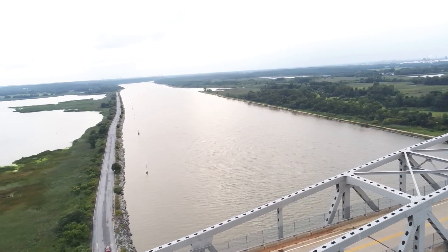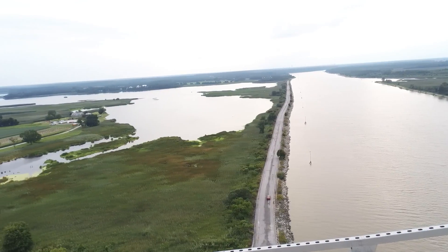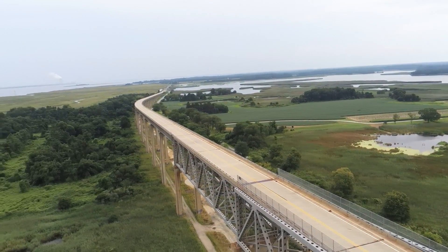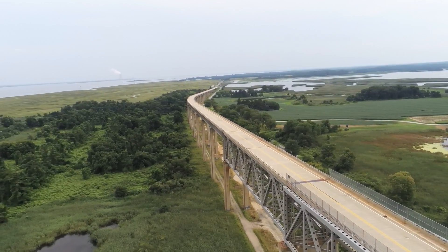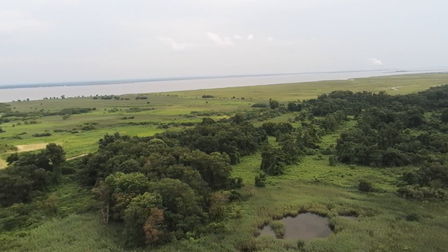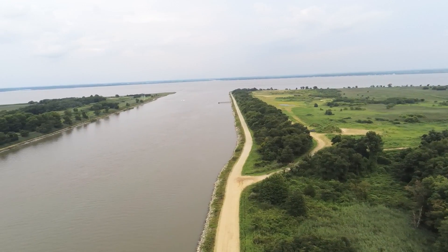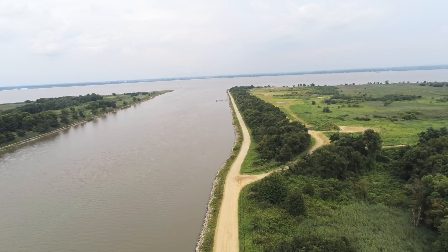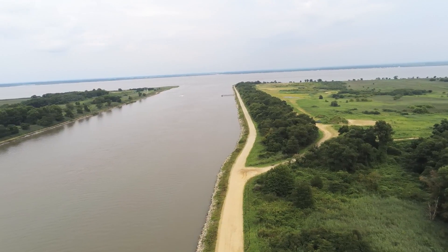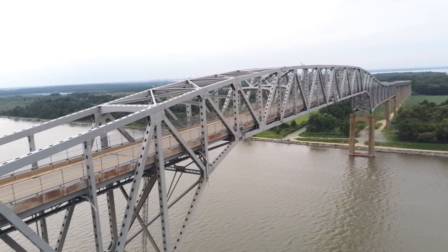As you can see, the top of the structure is arched and the decking part is flat. As we rotate over, there's the canal — it's beautiful. There's the length of the bridge; you can see the truss system switched over to girders, and the concrete decking, which I really like. Concrete decking will tell you what's going on with the structure just by whether cracks are appearing — then you've got some movement. Asphalt is going to hide those mostly. And there's your entrance.